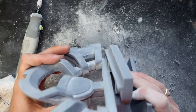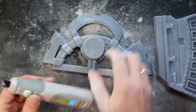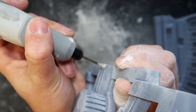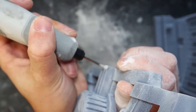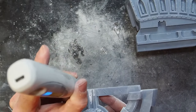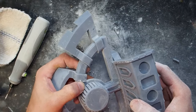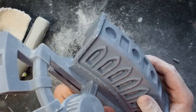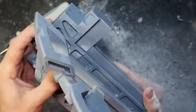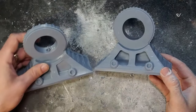That was feeling a lot better. What was holding it back is that top bit in the center, where we had to come back in and remove some plastic using the rotary tool as smoothly and controlled as possible, going all the way around it. After coming back to it a few times, it fitted perfectly. I've done the same on the opposite side — that one's also fitting in really well. So after dry fitting them together, this is how they've turned out, and this has really started to come together.